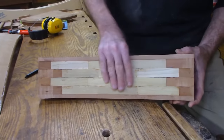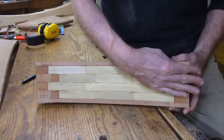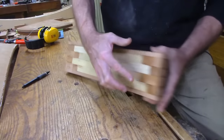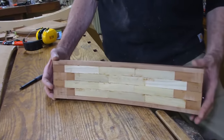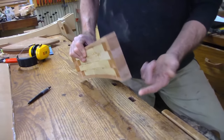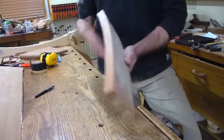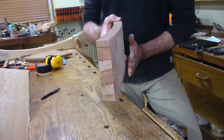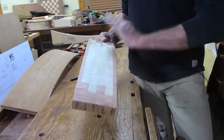And then I have done them like this before, and one of the problems that you find is if you just run right on out with the core material here, you see the lighter colored core in the dovetail pins. So by adding the last few bricks on the end with the same type of wood that you're using for your project, it'll appear to be solid, and you'll have your dark pins coming out on the end. So when you bricklay like this, you get some unevenness with the bricks, and you want to true it up to be absolutely true to the front edges of your drawer dividers that are already in your chest of drawers, because you're going to build a drawer out of this. So you want to true it up to a nice curve before you do so.